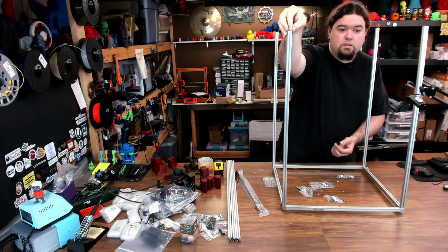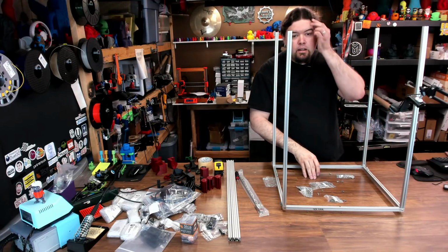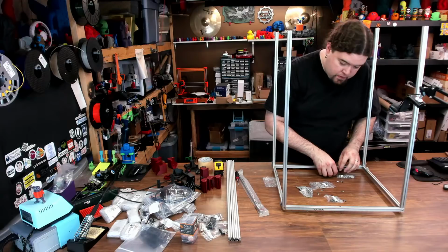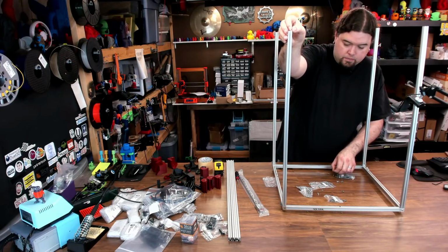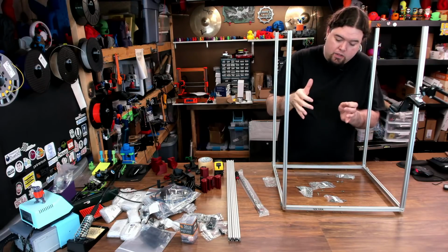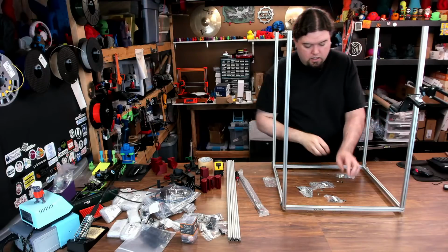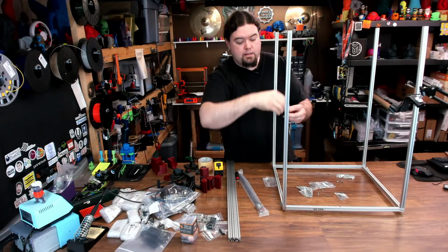Steve, what's up? Hello. You have a problem with your Mark III's fan duct? It's melty every time. That ain't any good. You have the Mark III's duct. You have the one that's split into the Y, right? That kind of goes around. Even the one that came with the kit is melty. Because I believe the one in the kit is still printed with ABS.